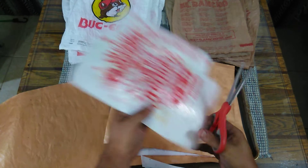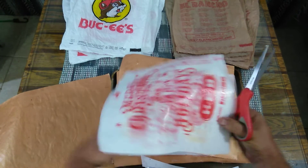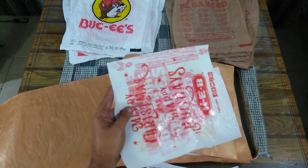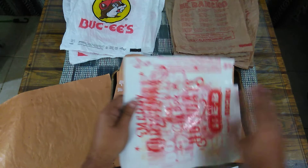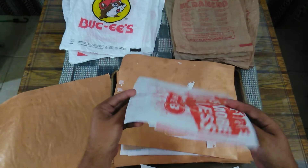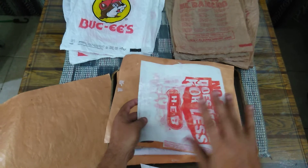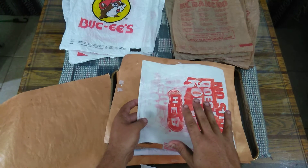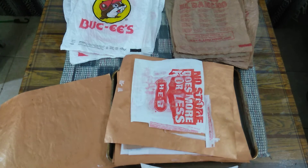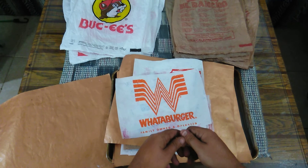You put it in at 350 degrees. We process HDPE — that's this type of plastic — at 350 degrees because it doesn't release any toxic fumes at that temperature. And then you've got your nice sheet that you can do projects with. If you wanted it to be thicker, maybe you can make a bunch of these and then press them together and smash them together. It's a great method. I hope you enjoyed it. I'm gonna go make some more stuff.